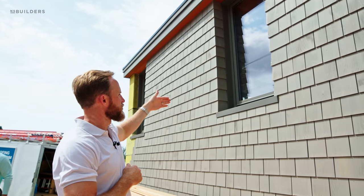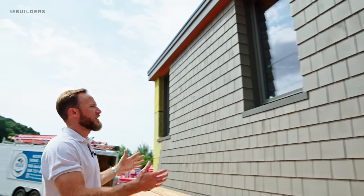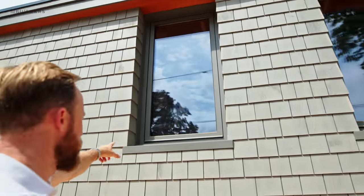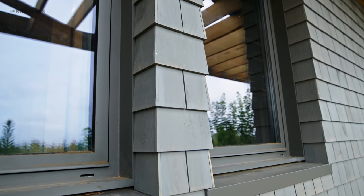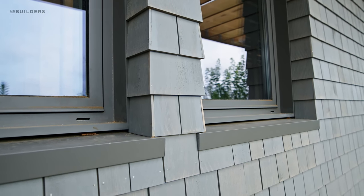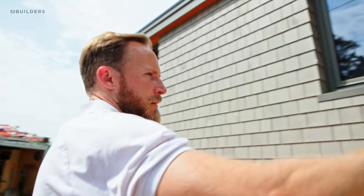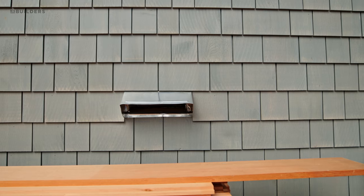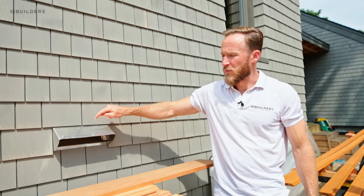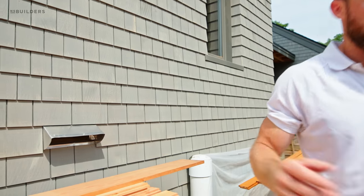We've actually taken those shingles and returned them back into the window, so the white cedar shingles are acting as the window jamb. When you step back you still get that woven corner look — a really nice detail. Also calling attention to the custom sheet metal window sill that Mark Jordan bent up and had powder coated to match the windows. There is a gap under there — we were waiting on our color-matched sealant; the other three sides already got caulked with a non-color-match. Also calling attention to the vent we talked about in the previous episode — we have a paint from a local paint store that will get painted to match the shingle.